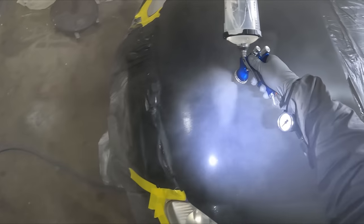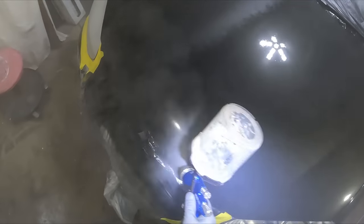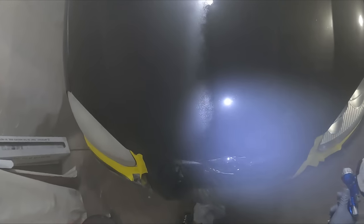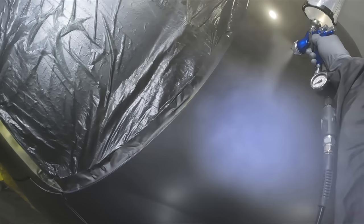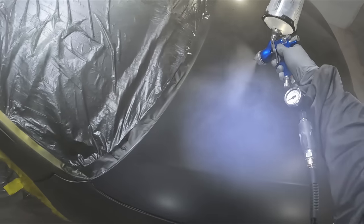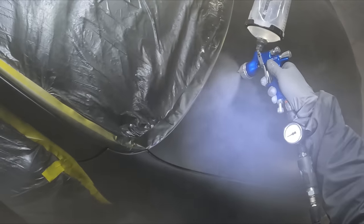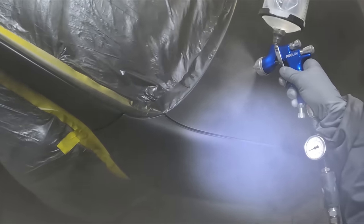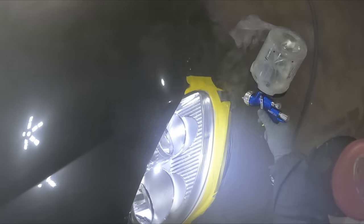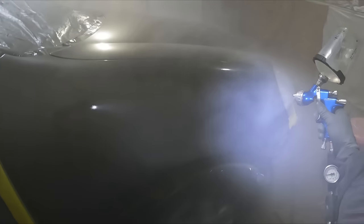I went for the T110 because this is actually the first decent-sized job I sprayed here at home. I've got a new compressor, and sometimes they make all these claims on the label, but you're not going to know how it actually performs until you get it home and start spraying. As it turned out, I was really impressed — it did not drop one bit of pressure the entire time. That's about five minutes per coat with the trigger pulled at two bar, which is 29 psi. I'm going to do a proper review on it in the future. Another thing I really liked is that it's silent, so you're not annoying the neighbors even if you're working in the evening.